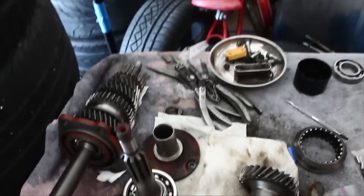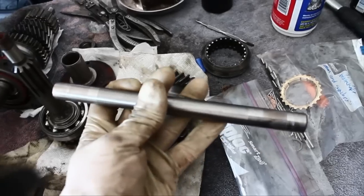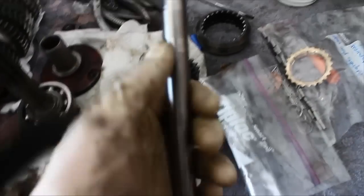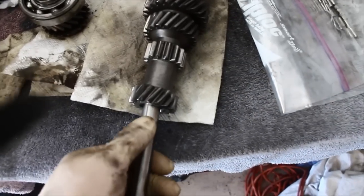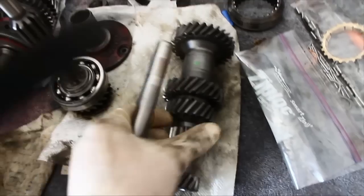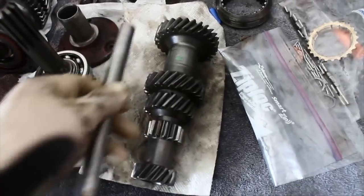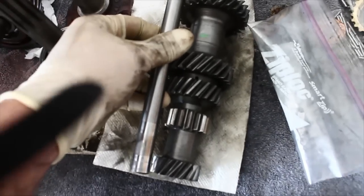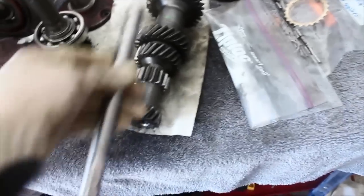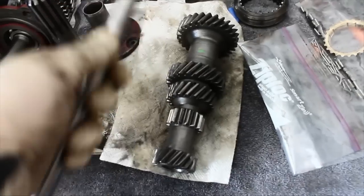I had one snap ring break, so I'm waiting for a replacement. In the meantime, I need to cut the countershaft rod from our M40 — which is just a spare M40 — a little bit shorter, so that when I stick it into this new countershaft it's going to hold all of the new roller bearings in place. There are going to be a couple of gyrations as we're setting everything, and we can't have this in place just yet because it has to be low and we don't want to risk dropping any bearings. So I'm going to cut this the exact length of this shaft — about an inch and a half short — and then tap the new one in, pushing this one out while keeping all of the bearings together.